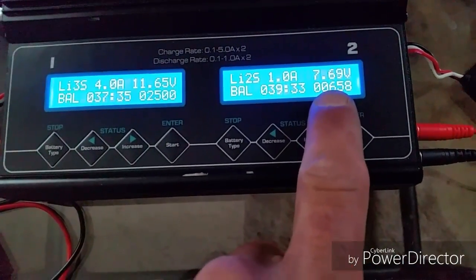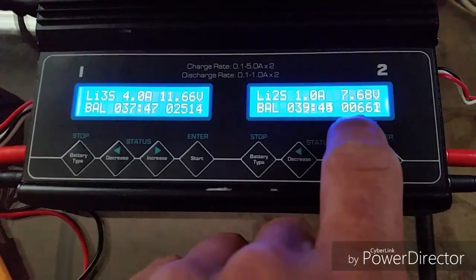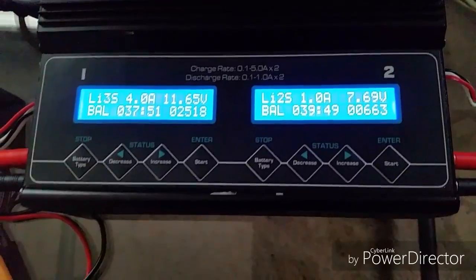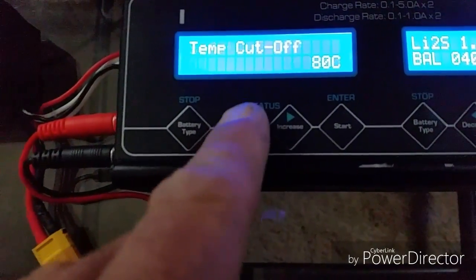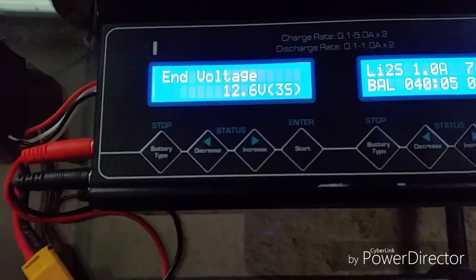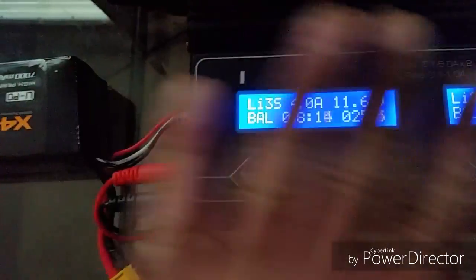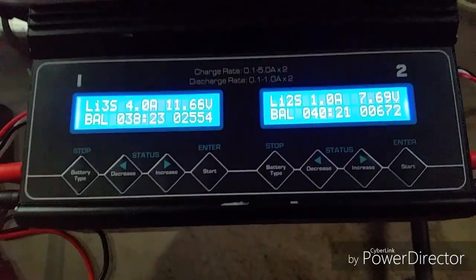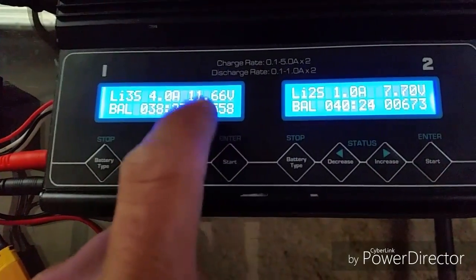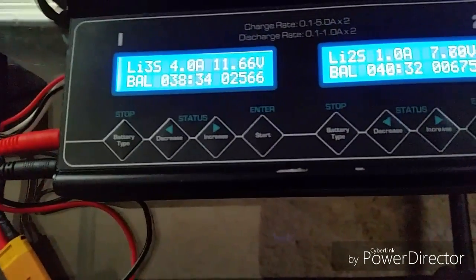The charger will stop when the H501S gets to 2,700 milliamps. It uses a microprocessor to prevent it from reaching 8.4 volts before hitting 2,700 milliamps — it makes sure the battery is fully charged rather than just ramming voltage in, because you need the milliamp hours too. The end voltage for any 3-cell should be 12.6 volts, and it won't stop until there are 7,000 milliamps in the X4 Pro. If it detects a problem, it will automatically stop. Capacity is what you need to worry about — just because the voltage says something does not mean the battery is fully charged.